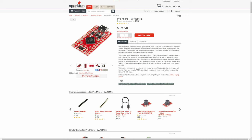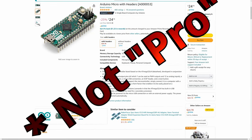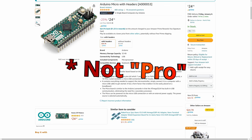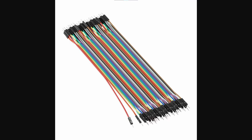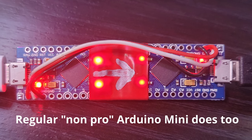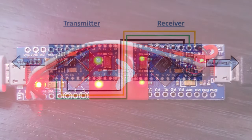I'll start with the hardware. For this build you'll need two Arduino Pro Micros, some wire — preferably three colors — and most likely the ability to solder. I say most likely as I think some Pro Micros might actually come with pre-installed headers, so if you get those you'll need a breadboard and some jumper wires. The Arduino Pro Micro is my choice for this project as it uses an ATmega32U4 chip which gives you built-in USB connectivity and an extra serial interface too, both of which we're going to take advantage of. Just make sure you get the 5V version.